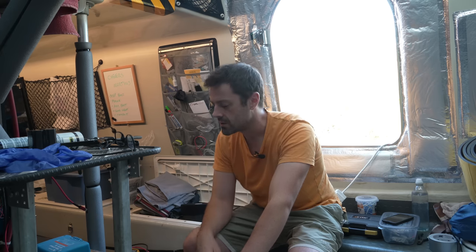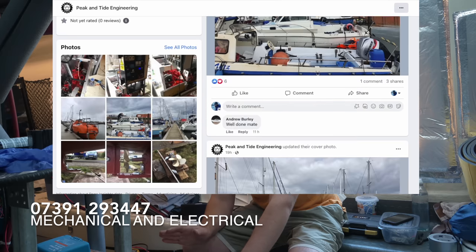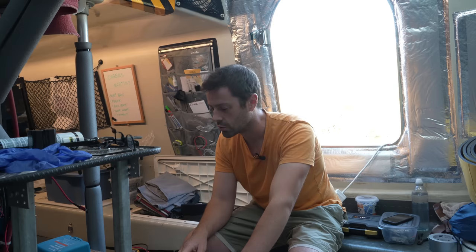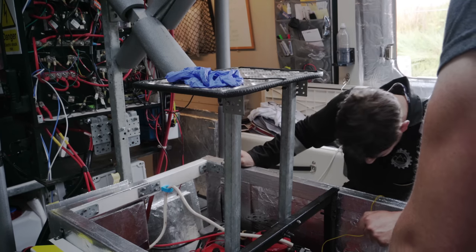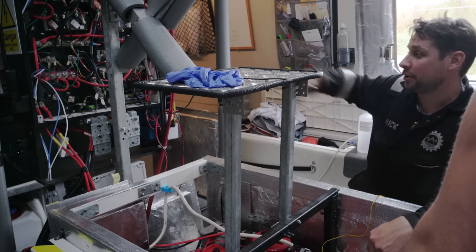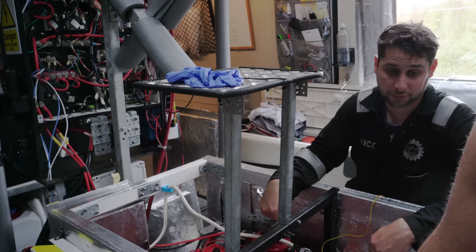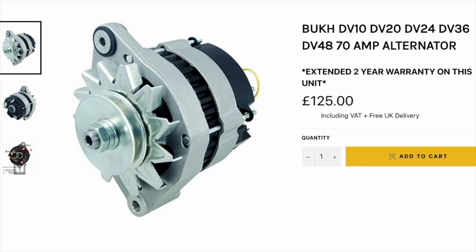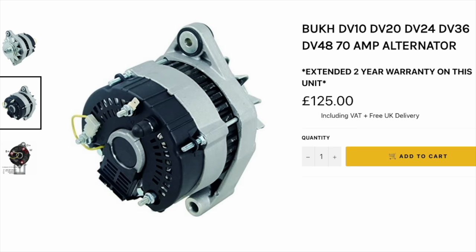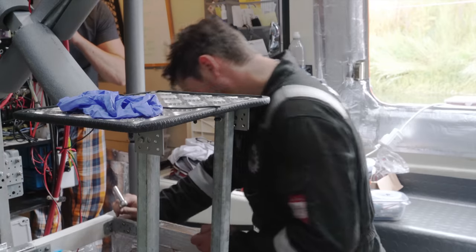Luckily a guy called Nick came by to find out what was going on with Alan, and I booked him in to come and give me a hand because he is a local who is both an engine guy and a mechanic, but also understands this wizardry we call electrics. Even at idle the alternator, which is pretty new, should be offering mid 13s up to about 14 volts to charge a 12-volt battery. Just an hour with Nick identified and fixed the issue: the negative side of the alternator's charging circuit was placed on an isolated post, which is apparently a car not a boat setup. We connected the terminal to the boat's negative post and got an instant fix. We also discussed the rudder post and that reassured me it's okay to rattle on until next time Alan is out of the water.